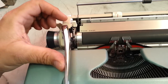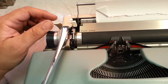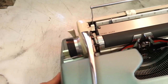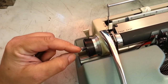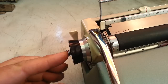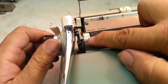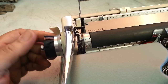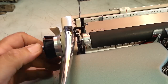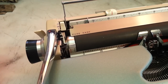You can go one, two, or three spaces. There's a paper guide here - when you put your paper in, you can put it up against that guide and get it in the same way each time. This side also has a variable release: inside this knob there's a button that pushes in and pulls out. When it pulls out, it moves the roller freely without letting the chrome ratchet turn. When it's in, the chrome ratchet turns and makes a clicking sound. If you need to line something up closely, you can pull it out, turn it slowly, then push it back in.